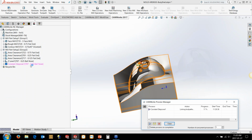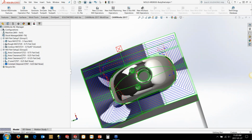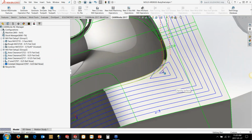Obviously, it's not being set up to be the 5-axis yet, but you'll see what I mean by the contain and avoid. So this is currently doing the contain. You see it's just offsetting from the outside profile, and then it's coming in here and kind of getting confused what to do in these corners and kind of running pretty close to this wall.